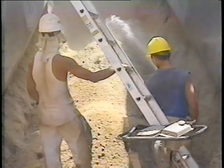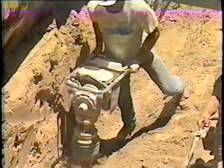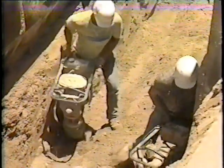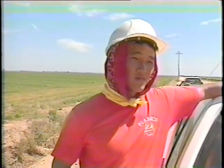Each lift of bedding should not exceed one foot in depth. Three to four passes over a lift are normally sufficient for achieving compaction. Compacted bedding material should occur to 12 inches above the pipe. Some jobs, such as those in streets or very deep locations, may call for more compaction — the engineer's specification will verify the required level. With Spiralite you have to make sure you have enough compaction so you don't have any deformation. Pipes have all been staying within spec. We've been getting a lot of soil tests alongside and over the top of the pipe.